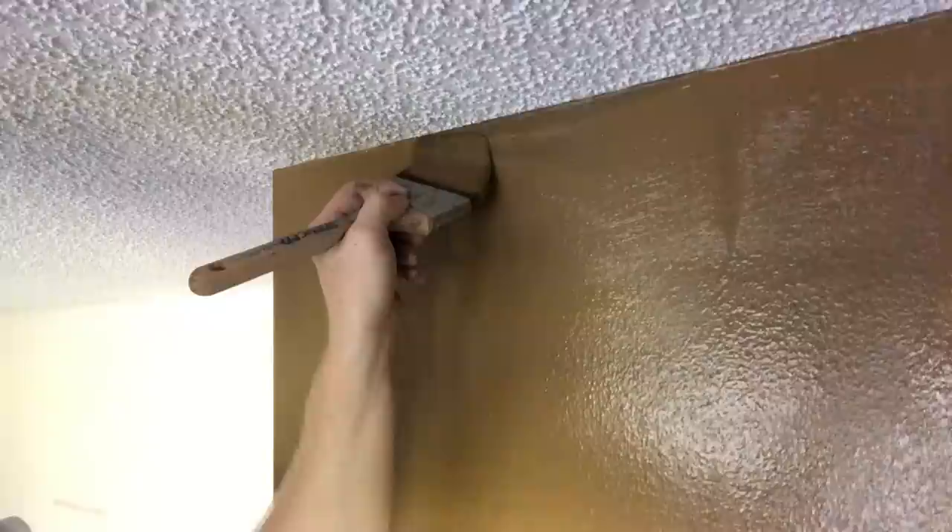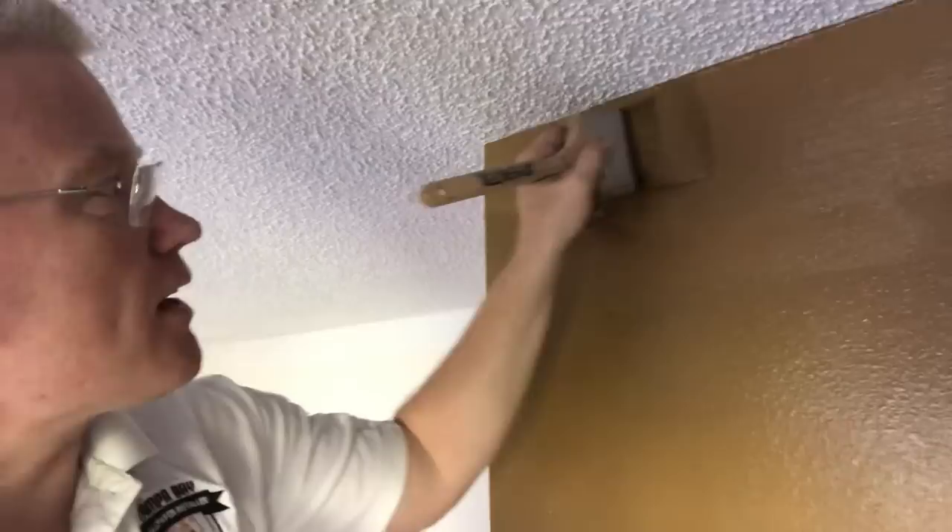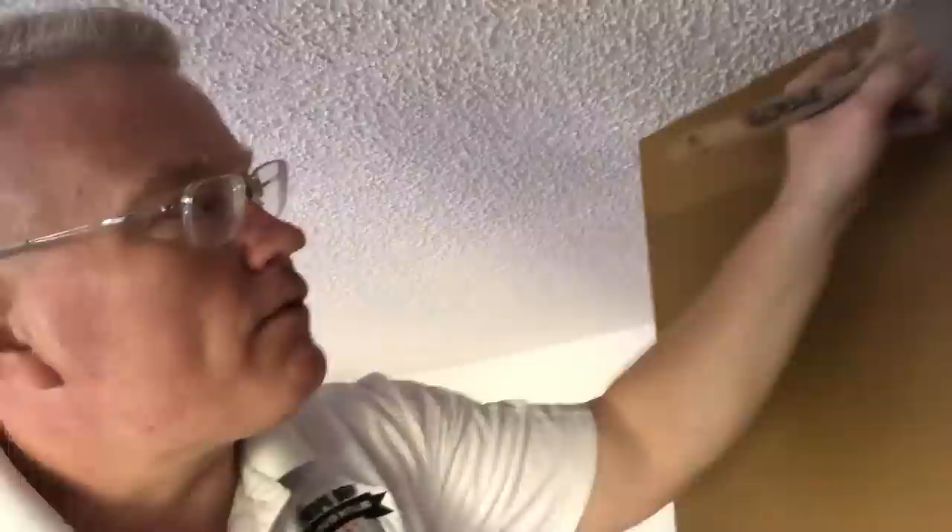There's no resistance because the brush isn't pulling the way it did on the first coat — it's gliding, because I have a dry layer of paint under it. That's when you want to fill in all the little nooks and crannies you missed on the first pass. If you're hiring a painter, ask him how many coats he does. He'll always say two, and you don't have to do two coats on a white ceiling unless it was a dark color.